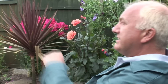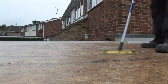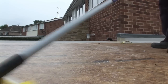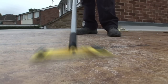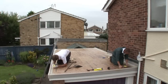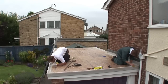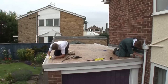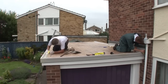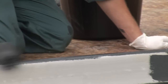We're onto the sanding stage now. Get your 40-grit sandpaper and work from the driest areas first, then lightly sand the entire roof space — blending in the bandaged edges so that the finish looks good when viewed from below, flattening any loose strands, and making sure the whole area is keyed in so that your colour top coat goes on easily.